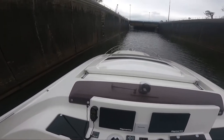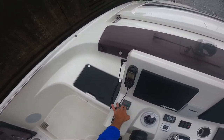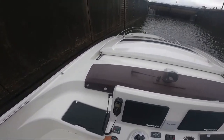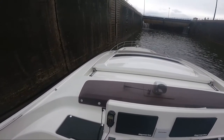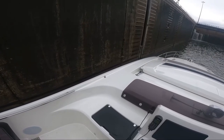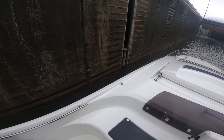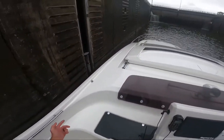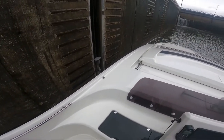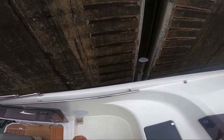I'm back in neutral, just letting the boat drift — just in-and-out clicks at this point. We're going to go nice and slow. I'm turning on my bow thruster just in case we need it. I'll reverse the starboard engine to straighten the boat out a bit, and then use the joystick to finish the alignment. I can be off to the side and look down the bow, slowly pulling the boat over to the wall. I can twist the joystick to give me a proper approach and make sure I'm nice and flush with the seawall.